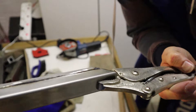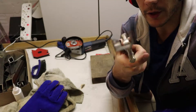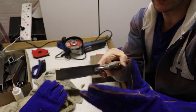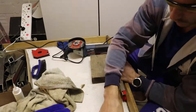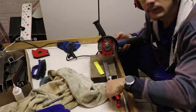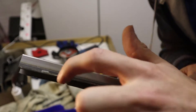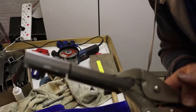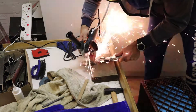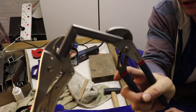That's one side down, onto the other side. And there we go — bottom side cut off. Next step is going to be the bend. Now to bend this with this leg we'll need to cut some indents, so let's mark those and get them done. To make it match up better and weld easier we're going to cut out triangles at 45 degrees on each side. And there we go — you can still play around with the angle but that should do it.